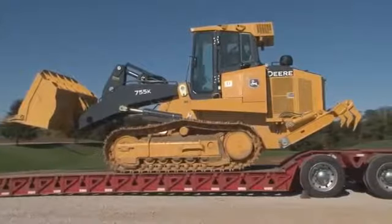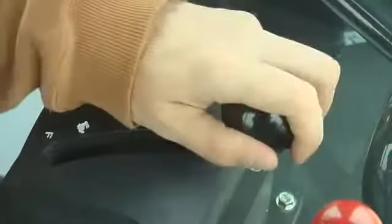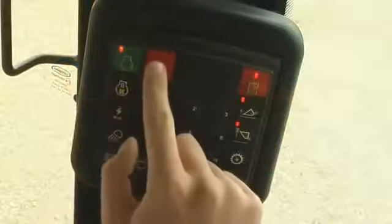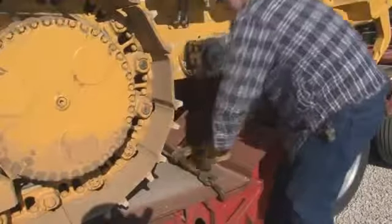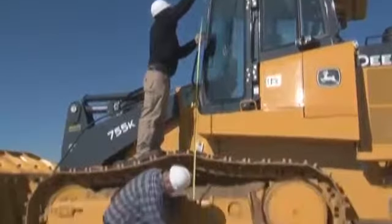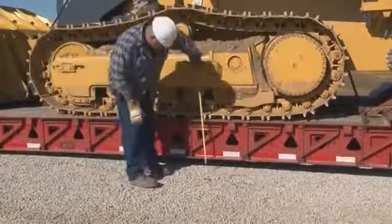The unit should also be balanced fore and aft on the trailer. Once on the trailer, move the FNR lever into neutral and lower the bucket and any attachments to the trailer. After cool down, shut off the engine. Lock up the unit against vandalism. Fasten each corner of the machine to the trailer with a chain or cable with appropriate load binder. Before you haul the machine, be sure of its overhead height to the ground — it's better to know your limitations beforehand rather than learning the hard way after you hit something.